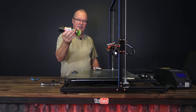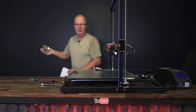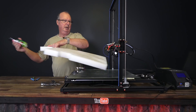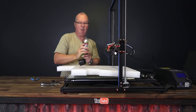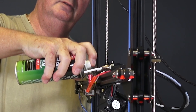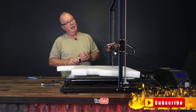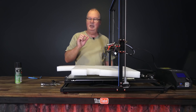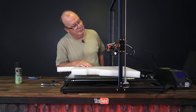Next, the magic spray. As I said, it's like paint — there's a ball bearing inside it so you have to give it a shake. The whole point of this stuff is to stop things from sticking, so the last thing you want is any of it getting on your bed — we'll cover the bed. Give it a shake, then all you do is get the spray and down the hole it goes. That's it — fixed. That is now lined with PTFE inside the all-metal hot end, a very fine lining but lined just the same. We'll give that a second to dry off.